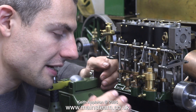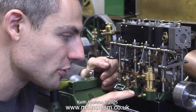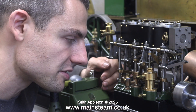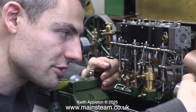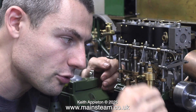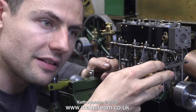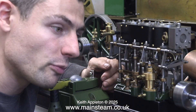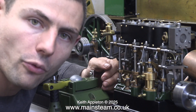A jet condenser does not need a cooling water pump because the cooling water is drawn up by the vacuum of the condenser. In fact, when you start the engine, it's the Edwards pump itself — which is a vacuum pump built to handle wet gases — that starts the condensing jet. The first few revolutions of the engine make just enough strokes to suck cooling water up that tube like a straw, starting the cooling jet. As soon as exhaust steam comes out of the engine instead of flooding the condenser it begins to collapse, creating a bigger vacuum which draws more cooling water, accelerates the process, and the engine turns faster.